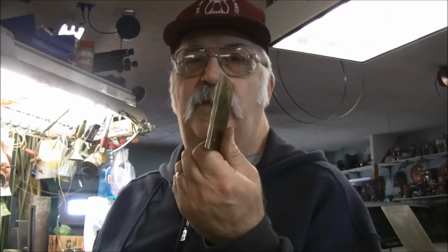So what I'm going to do is I've got 3 of them double taped together here, making 1 extra, just in case the gremlins come out. And I've got a fixture plate on the NC machine, and I'm going to double tape this to the fixture, and then just put a clamp in a couple of the corners and drill holes and machine it out, and we'll see how that goes.